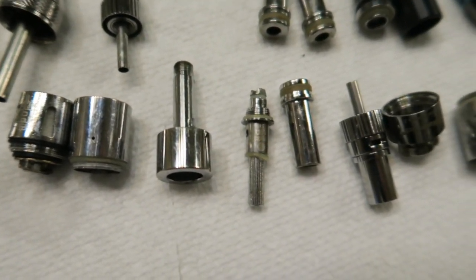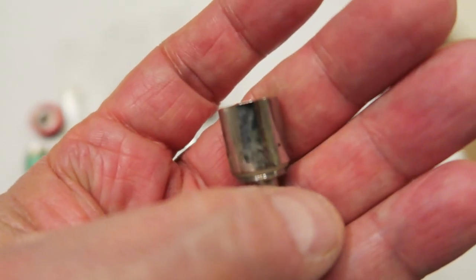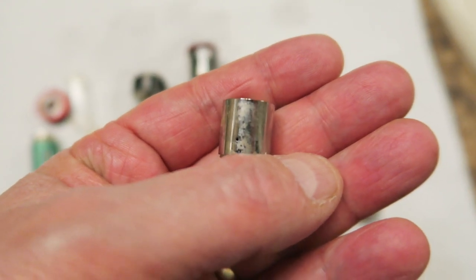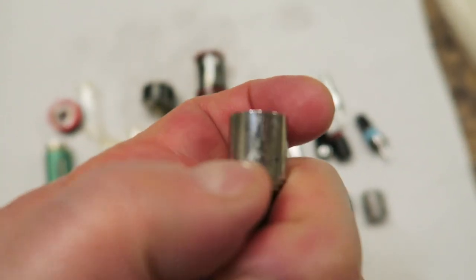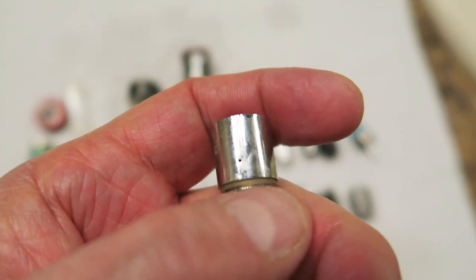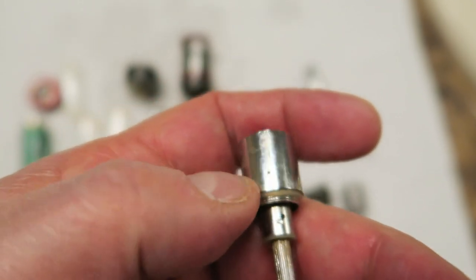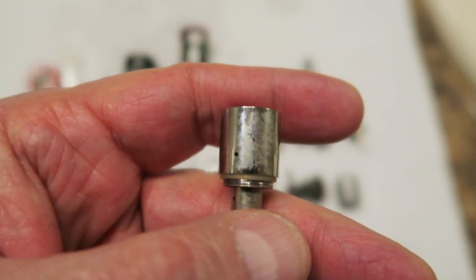Overall, these are perfectly acceptable to put back in service. When all is said and done, this process provides pretty good results, but it does still leave an annoying haze on some of the metal parts. The haze is sort of a light waxy buildup, which can be hand-scrubbed off if it's annoying. A tip I heard from a watchmaker is that the addition of alcohol into the process leaves their watch gears bright and shiny. My assumption is that alcohol would have to be introduced at the very end — maybe a third step, soaking in alcohol after the boiling. I haven't tried it myself, but it sounds logical. If you have any suggestions how to get rid of this haze, please leave a comment below.